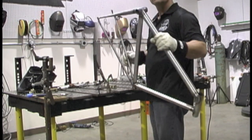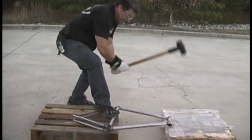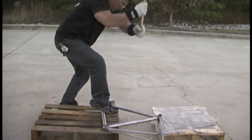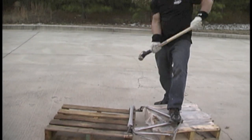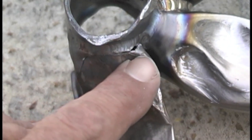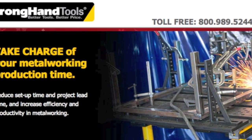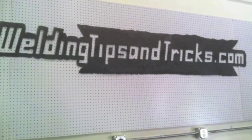Now it's all ready to weld up — more of the same pulse rates, but for the whole back end I welded with the ER70 rod. Then I carried it outside and whopped on it for quite a while to stress pretty much every weld. The Weld Mold 880 and the ER70 rods — one side on the bottom is ER70 and on top is the Weld Mold. Both sides held up really well. The ER70S rod fractured at the toe of the weld rather than in the weld itself, which makes sense against the 32 thousandths wall. I wasn't able to fracture any of the Weld Mold welds, which was surprising. Thanks for watching — visit WeldingTipsAndTricks.com.